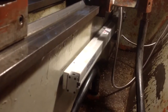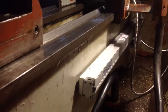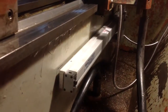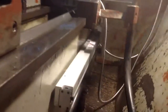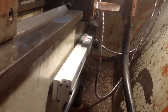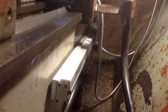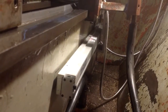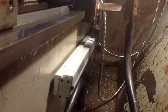Installing the scale on the back of the lathe was fairly straightforward, though I haven't mounted the cover yet. With the bits in the kit, the only thing is — if you're doing it on a Colchester — nothing on the back of the bed is machined or flat; it's all over the place. So you'll have to use angled shims and packings, and you'll have to spend a long time making them up to get a good result. That's the Z-axis scale. It just took time — it wasn't difficult. The principle is exactly the same as the cross slide installation, so check out that video.